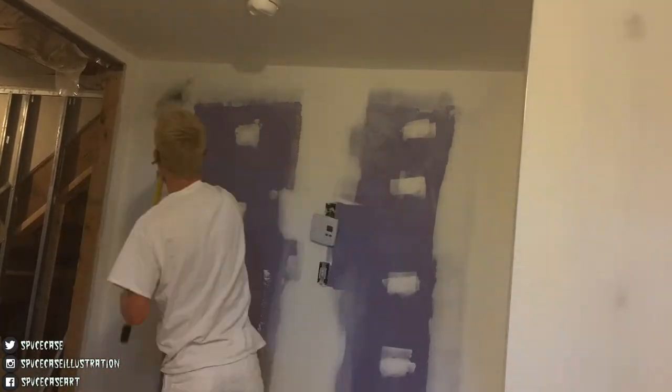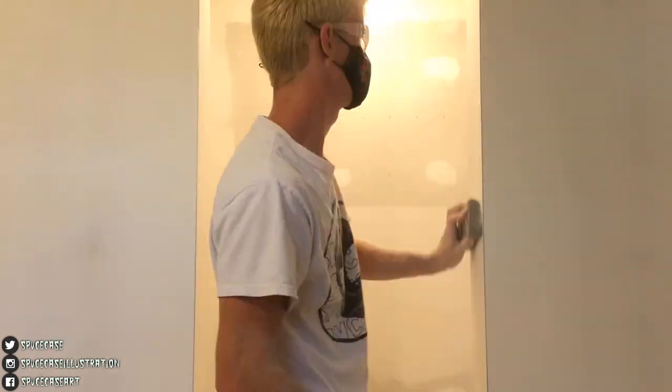I got a little too excited working and there are a lot more coats that you guys didn't see — and the entire ceiling too. I just got really into working one day and started pumping through it and forgot to film anything. Oddly enough, when you don't have a space to call your own, videos are the last thing on your mind. Once I had gone through all the layers of mud and had all the ceilings done, I had to sand everything down — it felt like forever. The mask I was wearing was not good enough. I recommend getting a good mask if you're ever doing drywall taping. I wore a fabric one and the amount of dust that went into my lungs was ridiculous. I had quite a cough. Don't be dumb like me — use proper face protection and safety glasses.